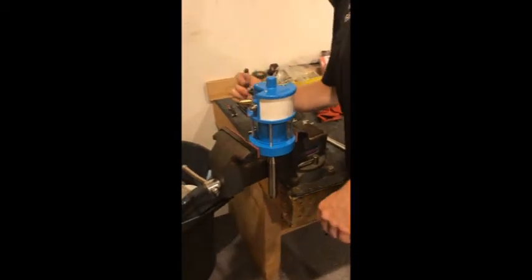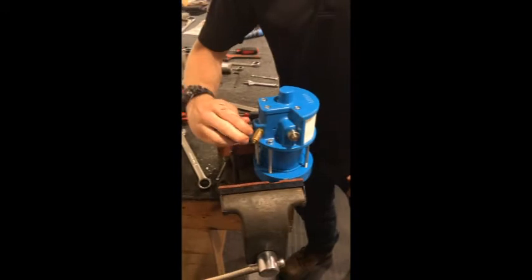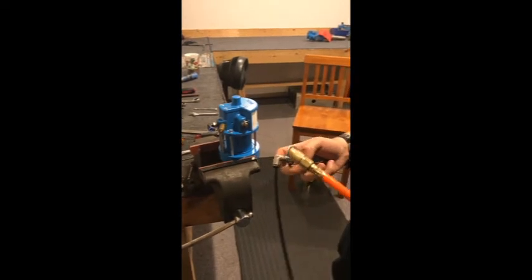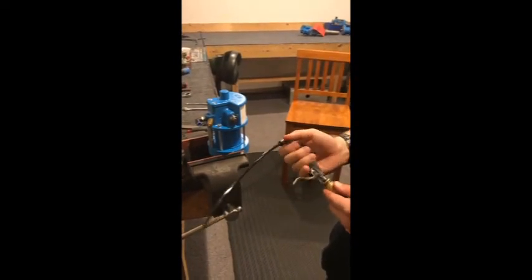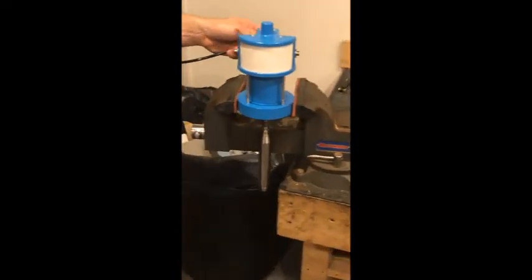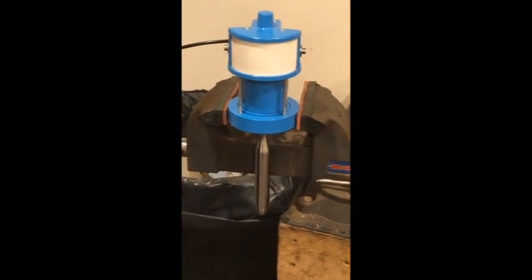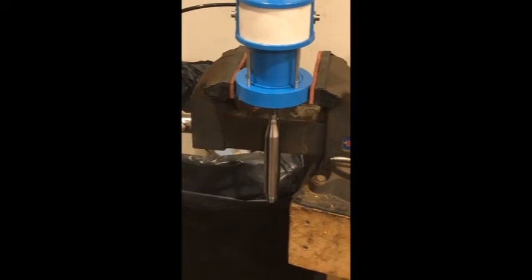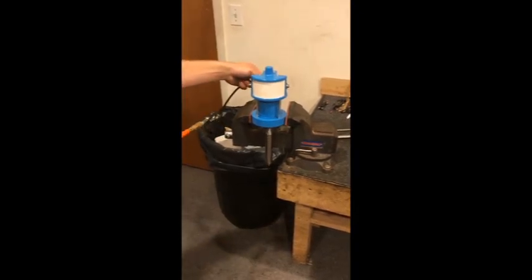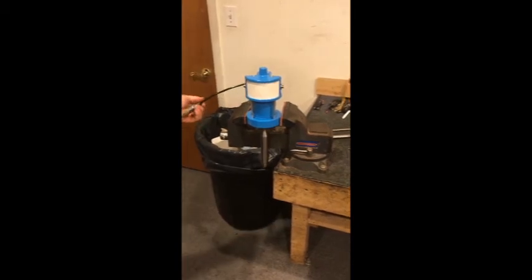I'm gonna make sure this is clear on the bottom and we're gonna test it real quick. I just have a quarter-by-six fitting — depending on which pump you have, you may have the oiler assembly for your 150 with a T on it. We have a compressor here from our shop; we've taken the rubber tip out of the end, which is an eighth-inch thread, and put in an eighth-by-six fitting. We're gonna put air to it. Come around the front first to make sure everything is operating as it should. You want to see that it runs with low air and then increase it. Your best indication is if you can run at a really low, slow rate of speed, because that's assuring you're not getting held up anywhere along the line. That's looking good.